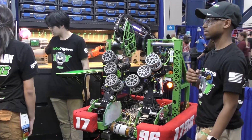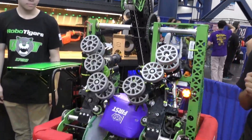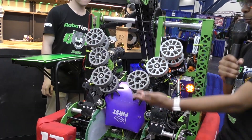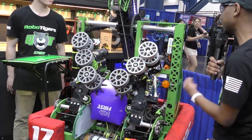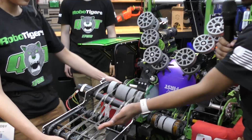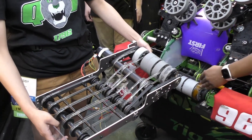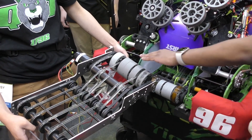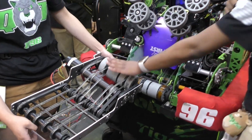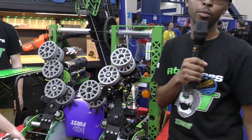Can we demonstrate that with your cube? Now talk about that process — it just gets right in and then your arm picks it up? So once we get past the intake, we actually have an indexing system that allows us to get from the intake to the arm. It's basically just a polycord system. We have an earlier version right here — it uses polycord and belts, as well as a few wheels located on the front to transfer the cube from the intake to our indexing system, have it pass through until it comes into our scoring delivery on the arm. Then it's basically in our arm ready to go.